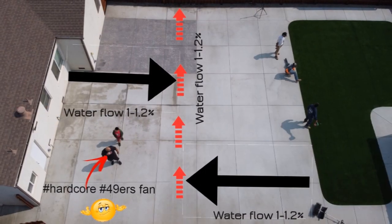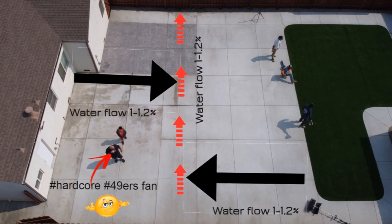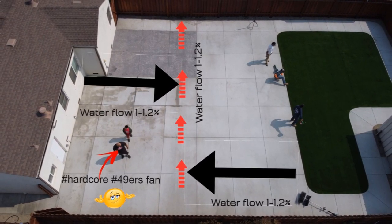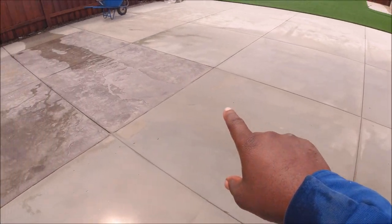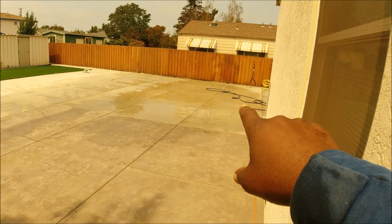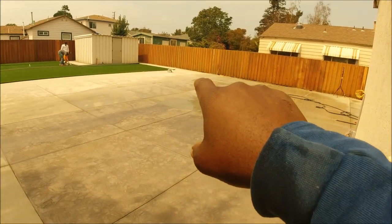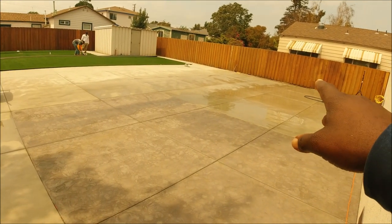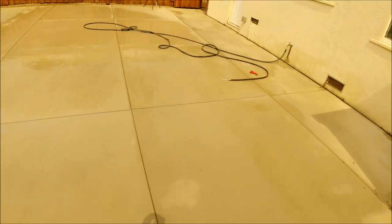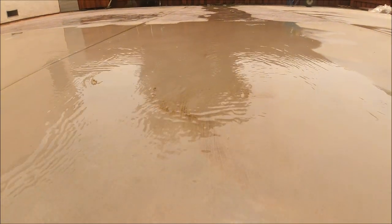The rule of thumb when grading for concrete is a two percent slope, but in order to make this patio feel functional for the family we went about one to one point two percent. If you look from right to left there's a slight V-ditch — you can barely notice it, but that's what we were trying to accomplish. From the house it goes out about 20 feet, and from the grass area it comes back down about another 25 feet and meets there, creating the slight V-ditch which takes the water out. Some people might have put a channel drain in, but personally that would have looked ugly, so at all costs we try to avoid channel drains or drainage outlets in our concrete — that's where years of experience come in.